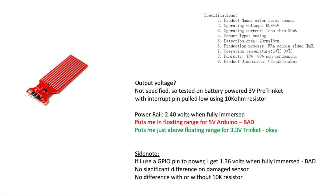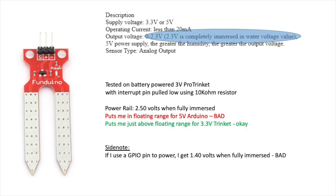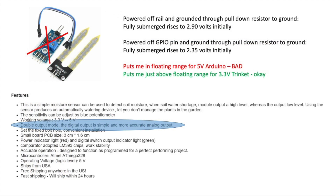As a side note, I did test various cheap sensors available on eBay on my bench to see what kind of signal response I can get when powered directly off a 3.7-volt LiPo battery. The water level sensors give me about 2.4 volts when fully immersed — sufficient to safely trigger the interrupt on a 3-volt Trinket, but not quite enough to guarantee triggering an interrupt on a 5-volt Trinket. I get similar results for other sensors if I use them directly with a pull-down resistor on pin 3. I'm better off using the 3-volt Pro Trinket for my field deployments to increase the probability that flow will trigger my interrupt pin.